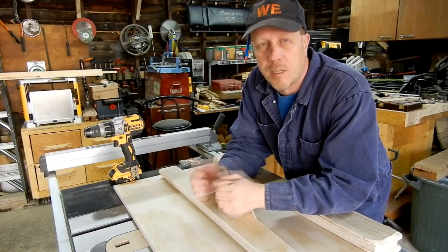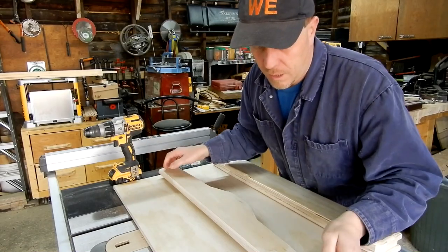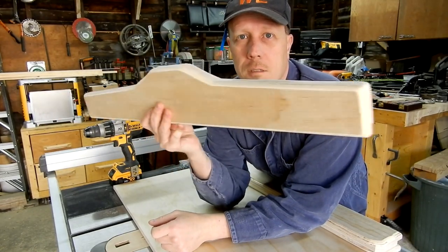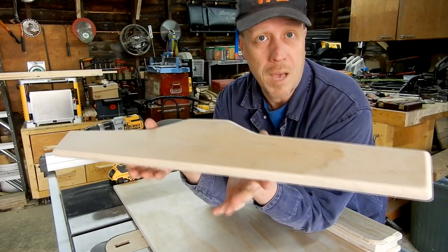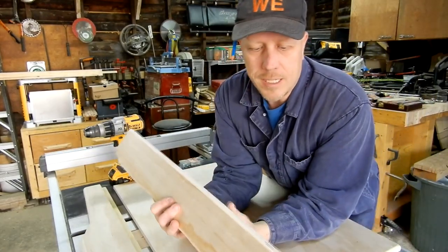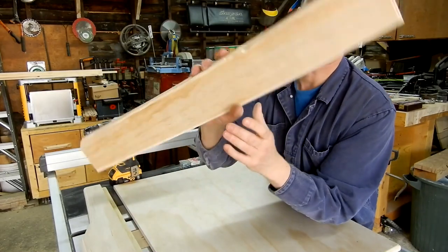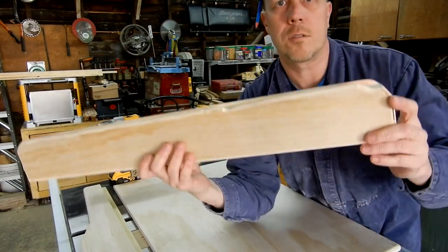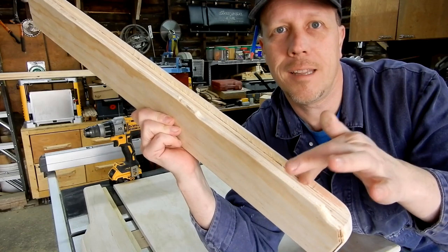I've had weight on this for about half an hour. In that time I chamfered my little shape, sanded it, and made it look decent. The front piece turned out good - I'm happy with it. The back, not so much. I started rounding out all the corners and making it nice, and then I came over here and started gouging it. As you can see, there's a spot right here where the router kind of dug in because of where I had my bearing set.